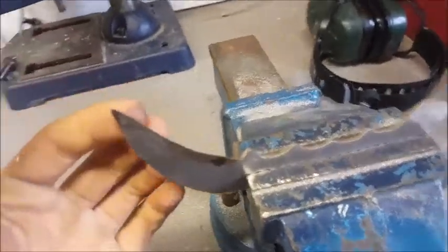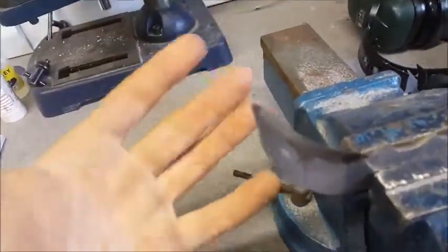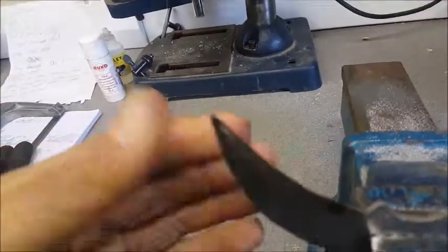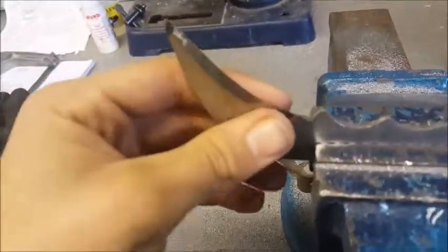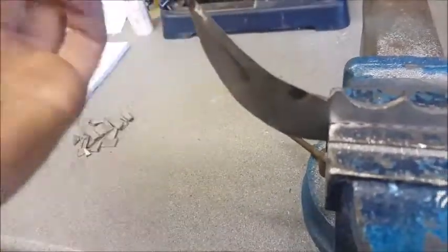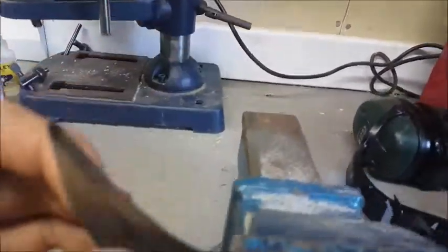This is what it looks like after the grinding — looks quite good in my opinion. It's a little bit sharper than I thought it might be but still holds a nice edge. As you can probably see, those overheated bits at the end and start are from where I held it too long on the grinding wheel — I've overheated the industrial heat treat so those bits are a lot softer. But that doesn't really matter because I was going to heat treat all of it separately anyway. It just leaves a dark discolouration. I've also slipped a few times and created some dents in it.